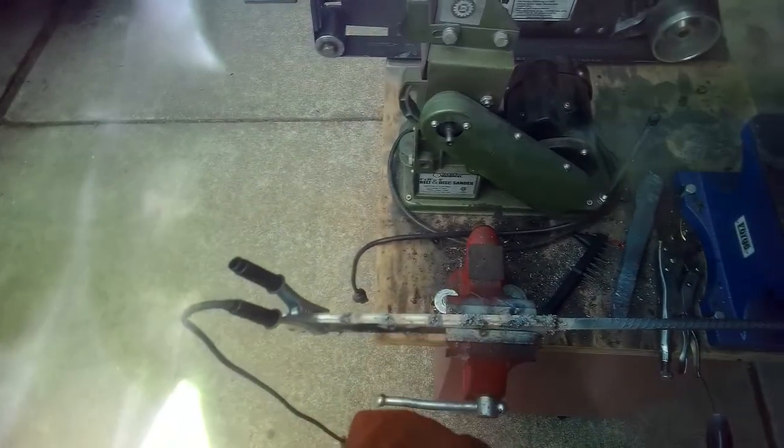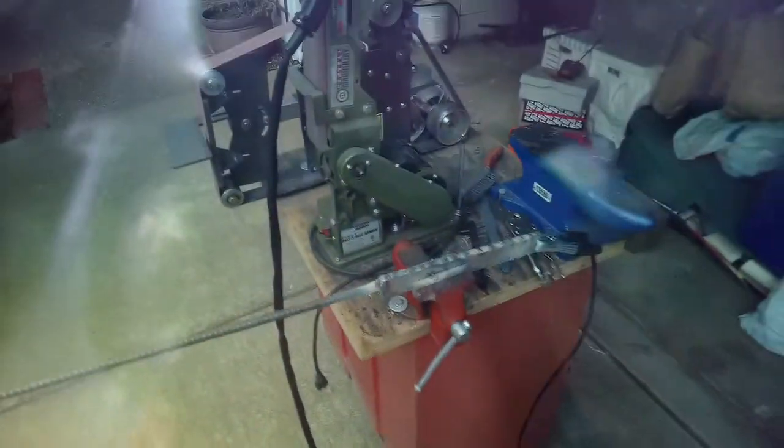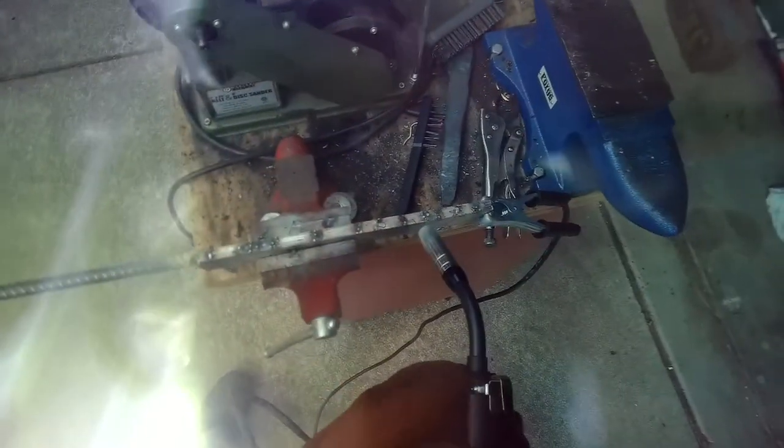Sure, we don't have a lot of splatter. With this Vivo Home MIG welder, it looks like if I go to the maximum setting and maximum voltage, with the fine-tune feed adjustment all the way down for wire speed, it does good — we're able to get a more substantial weld. I'm getting used to it. Some earlier ones are just kind of jumping around with a little slag, but to make a continuous bead that holds the metal together, I find if I take a little more time at the hotter settings I can do it. That crack sounds like frying bacon — that's a little bit better. Definitely got two sections welded together.